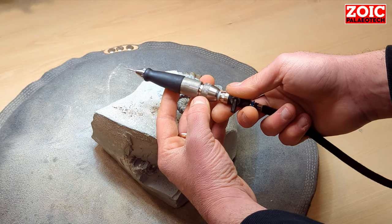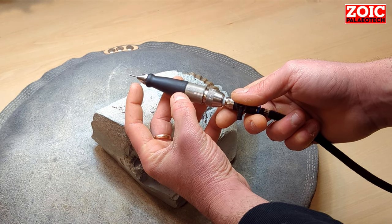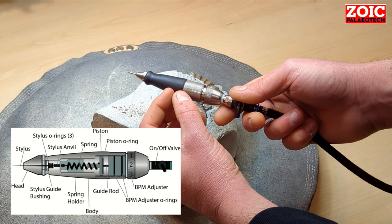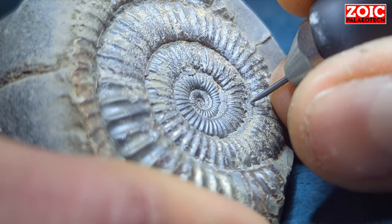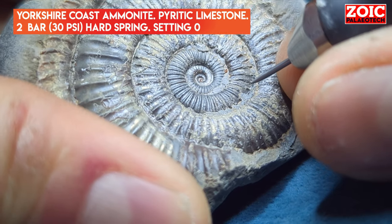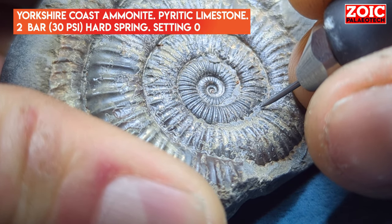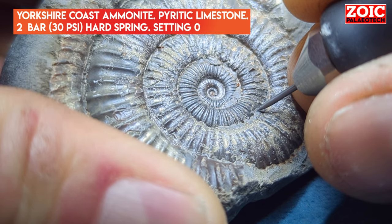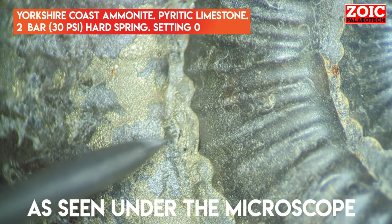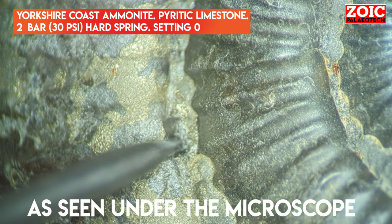This is because the piston — as this particular gap is closed, the head of the piston comes closer and closer to the anvil at the top of the stylus, lessening each individual blow while at the same time increasing their number. As a hybrid design, this provides the best of both worlds from the piston-driven tools all the way to the pusher-plate-driven tools. Depending on the choice of setting with respect to pressure, number selected on the beats per minute adjuster, stylus, and the internal spring, this tool will work on any type of rock and on any type of matrix to provide the best results for all.